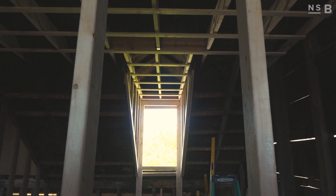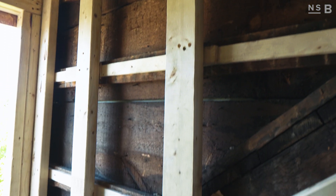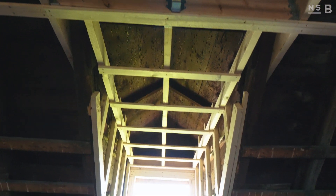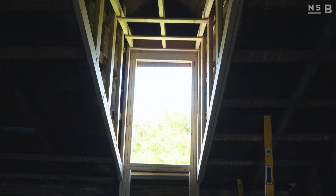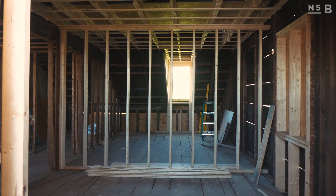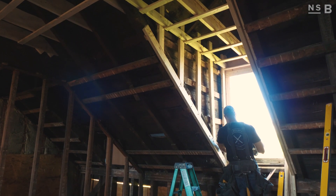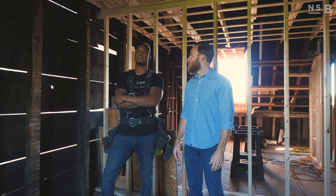With the original state of the dormer, we didn't have much R-value. We padded it out with two by fours, and that gives us a great R-value. Even with closed-cell foam we were just under R7, so before we had maybe seven-eighths of an inch giving us about R6 on that wall. Now we have about three inches, so now we're going to get the required R21. That makes a big difference, especially as we take the time to reframe the walls and ceiling. Now we're really squaring up these dormers so when we install that new window, not only does it look good but it also performs well.